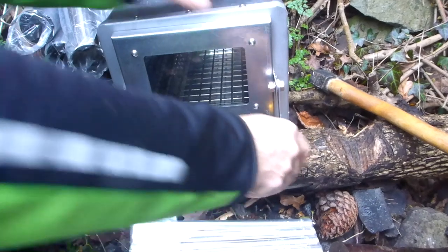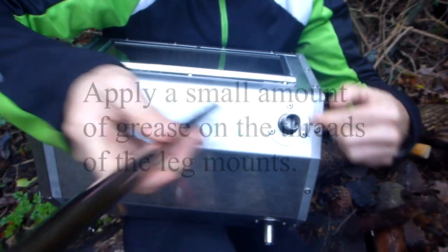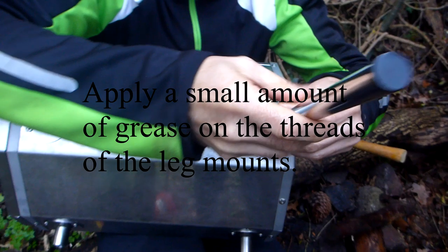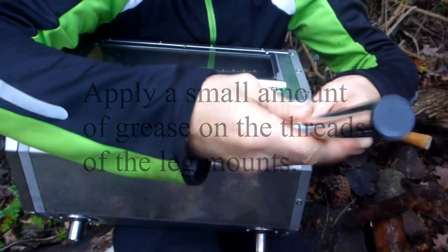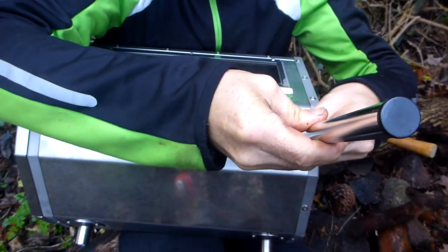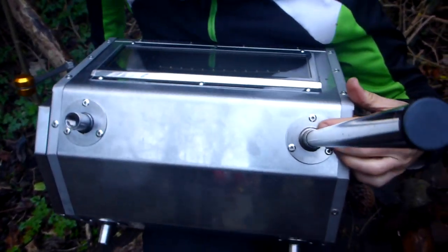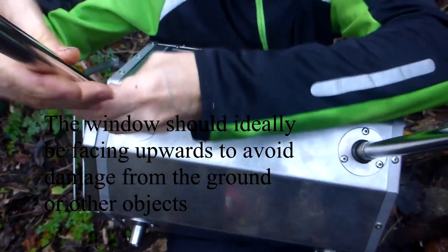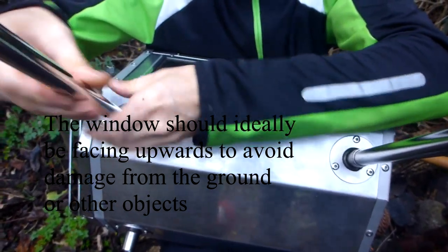I put a little bit of silicone grease in these leg threads — it's advised that you put something in there just to screw the legs in, to make them easier to get in and out later. You don't have to crank the daylights out of them; it's a very well-made joint. Keep the window at the top because you don't want the window at the bottom — you're going to break the ceramic glass if you're not careful. It's strong but not indestructible.